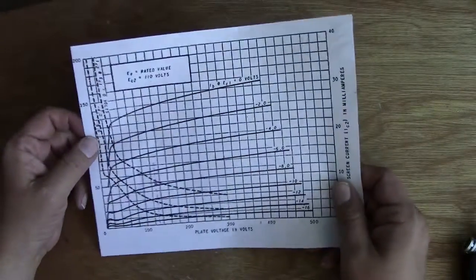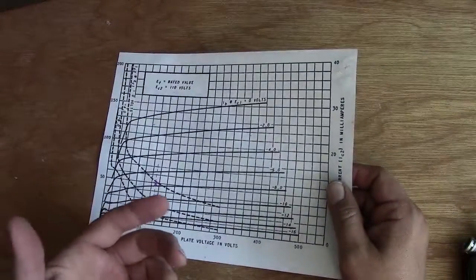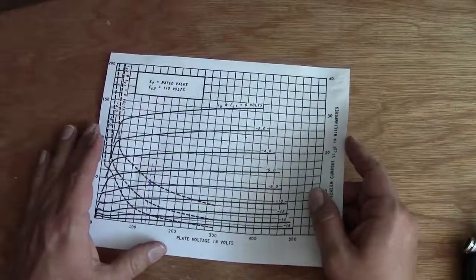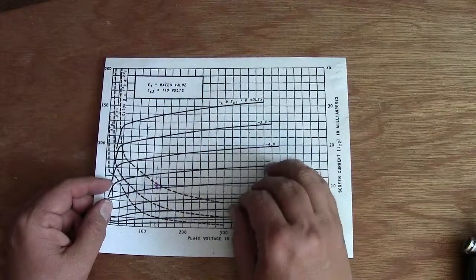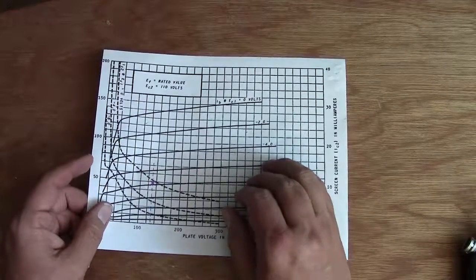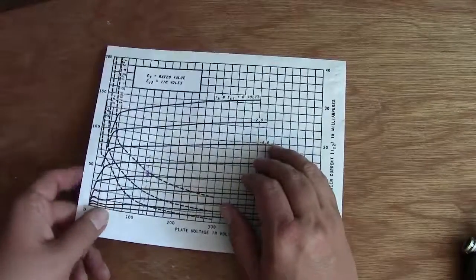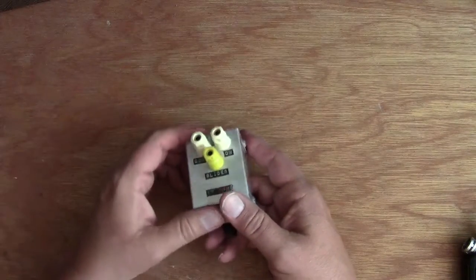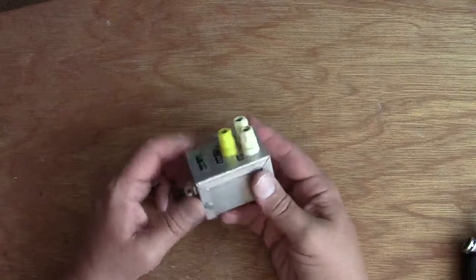I'm on a mission here in the Valve Studio to get the Smektron record player mod finished. And the next step for me after the analysis was to actually take some measurements here on the bench. What I want to use to measure the output performance, particularly the distortion, is an Android tablet that's running that sound analyzer program. And I want to connect it directly to the output power transformer. So in order to do that, I need to have a voltage divider on the output transformer. I have my 4-ohm load resistor, but I want to take the voltage down, so I need a simple voltage divider.